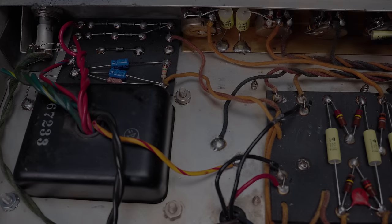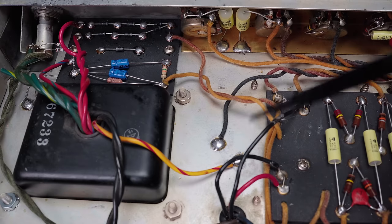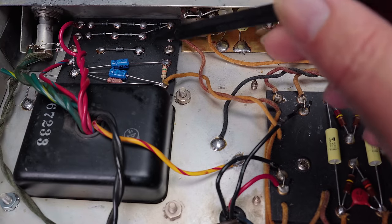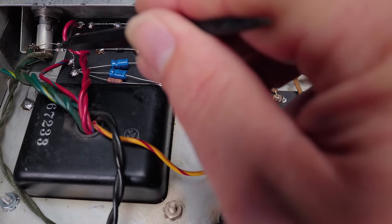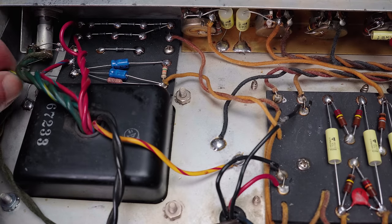I've just about finished this old concert. You can see here the chassis is much cleaner. I redid some grounds to the chassis that were a little bit solder-starved in the past. The bias board — everything taken off, everything clean, repopulated properly, the bias set, and some heater balance resistors added. I'm about to tape off the old heater balance center tap wire.